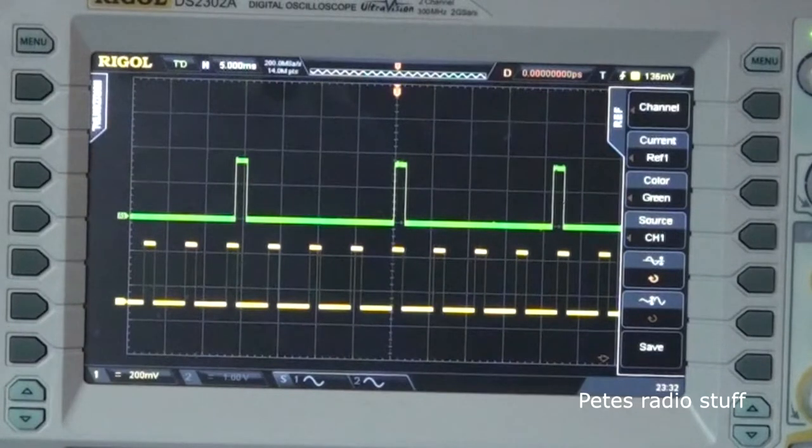This has nothing to do with digital, I don't think, because a standard pulse train will drive a digital servo just as easily as it will drive an analog servo, because the difference is in the servo, not in the receiver. But that's the reason it gets hot.